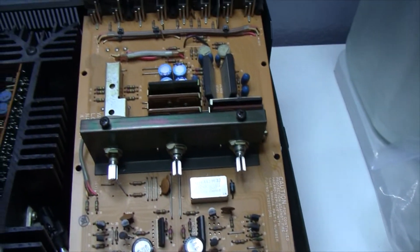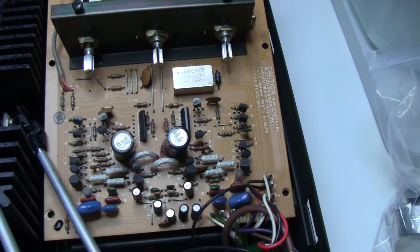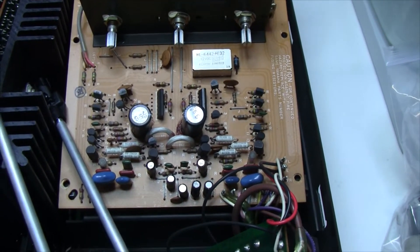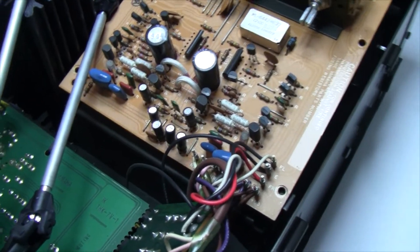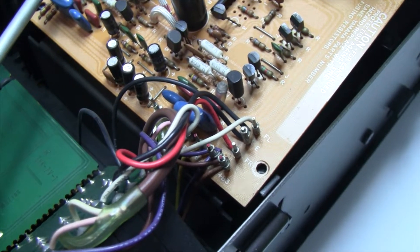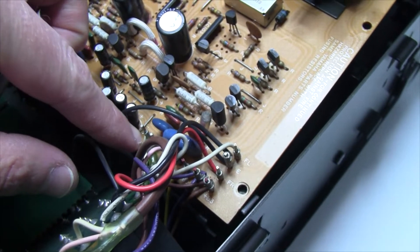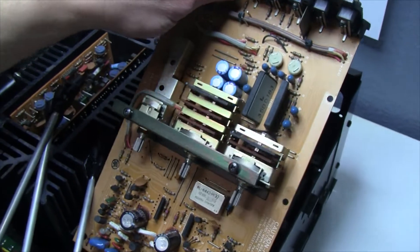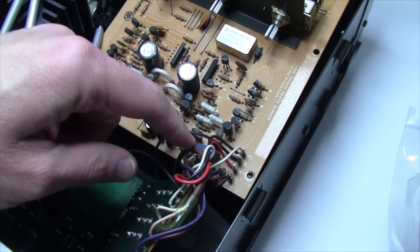Apart from that, the board slides out easily. Lots of screws to remove, and that's okay. The board is like a phenolic material, very common in those days, so you always have to be careful not boring it too much. The annoyance here for me are those wire-wrapped connections, which I don't have the tool for. I'll probably need to find a way to undo and re-wrap those, because you don't want to break those connections.